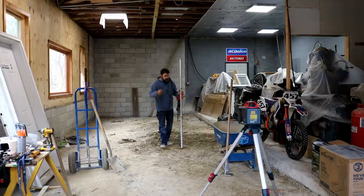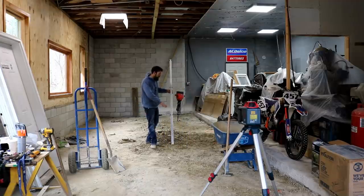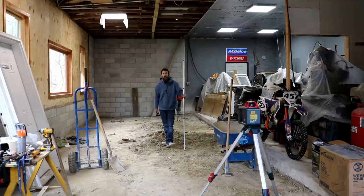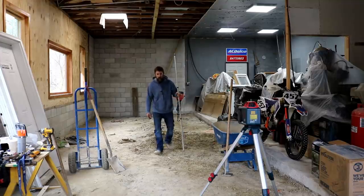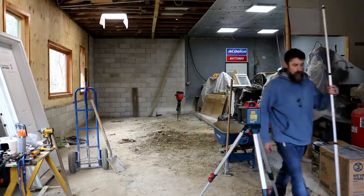So using a laser, took a reference off the original pad, comparing that to what I have on the ground. So in relation to that zero, I'll have at least 7 inches thick on my concrete pad. In short, I'm leveling off the ground, in a nutshell. That's all. And taking my old dirt and pouring it out in the trench beside the shop.